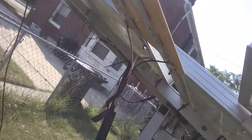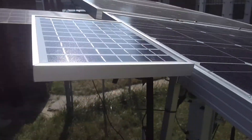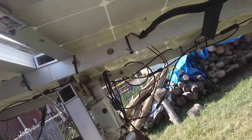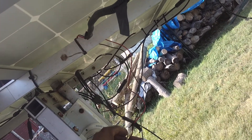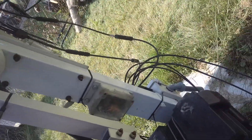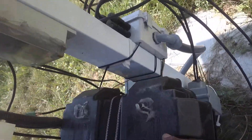I used two 10-watt separate panels wired in parallel — two positives connect to two positives and two negatives connect to two negatives of the smaller panels, and then they connect to the one positive wire that goes to the charge controller. I've got the box on this one.